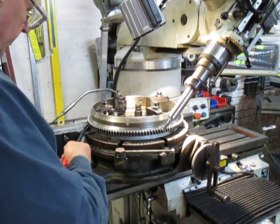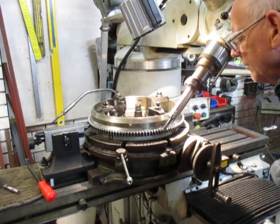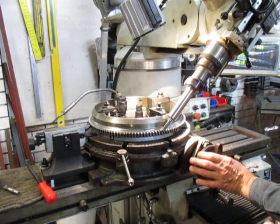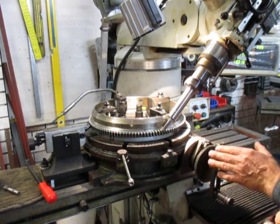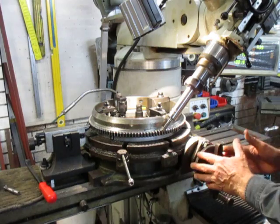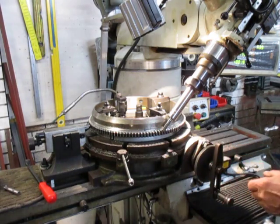I've no idea whether these have been repaired once, twice, or more often. As I said in the earlier video, I decided to go with this setup, which is quite novel I think. Instead of making an indexing plate for this — because I've worked out on the 90 to 1 I would have needed 18 holes in a 23-hole plate and I didn't have it. This is an old unit that I picked up pretty cheaply. I had no problem making a plate, it was just time.